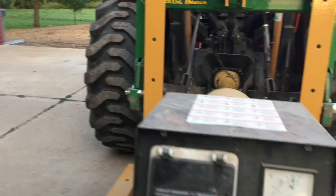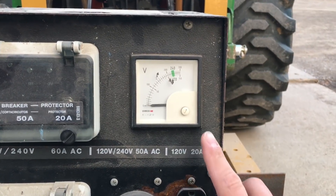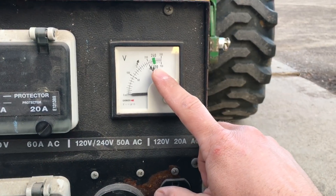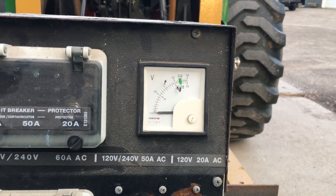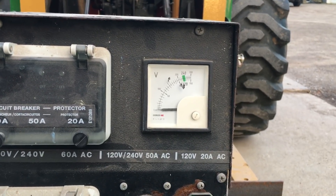This part is going to get a little loud because I've got to bring the tractor up to full RPMs, which will get me 540 RPMs at my power takeoff. Then I'm going to come back to the back of the tractor and look at this gauge. In order to give me the correct voltage in the house, this needle has to be up to right here in the green. I'll bring the needle to the high side of the green with no load, then bring the breaker in and adjust from there.